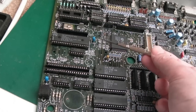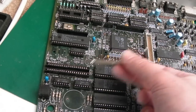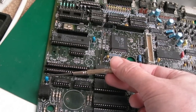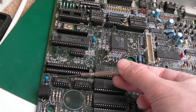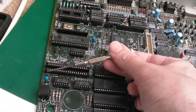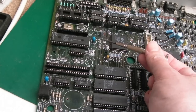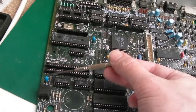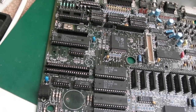These two tantalums were swapped out. The legs were just so bad on them. One of them, the legs just broke off. And then the other one I fitted on here, after I bent it once, it snapped off. So I thought, well, let's just change them both. They're slightly uprated. Instead of 10 microfarad, I think what's supposed to be on there, these are 22s. That's all I had, but it's not a problem. It's just smoothing. That's all they're doing. They're just smoothing. Nothing else.